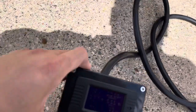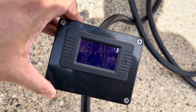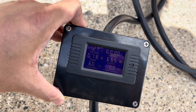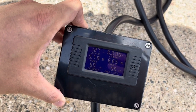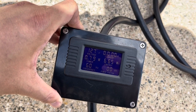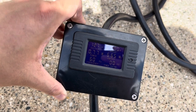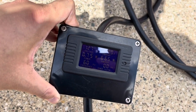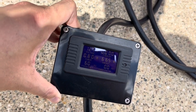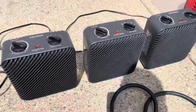Quick note: when you have a load on this generator, you want to read between 100 to 130 volts. Anything lower than that is not good. For hertz, you want it to always be at 60 hertz — if it drops below 60 hertz, that's not great either. We're going to keep an eye on those two, as they showcase the health of the generator being run on propane with our three loads.